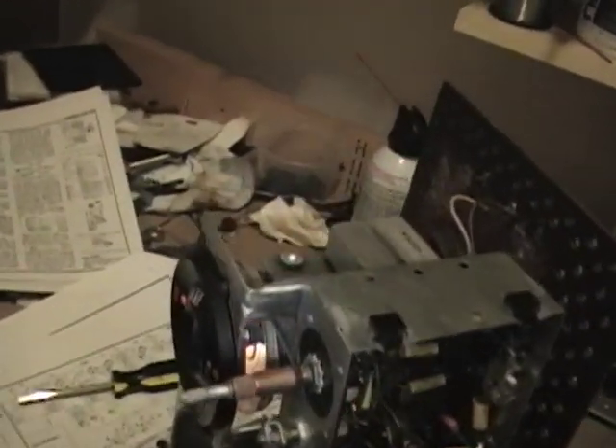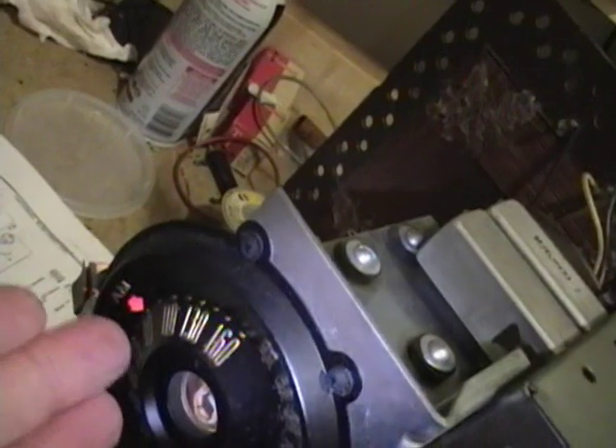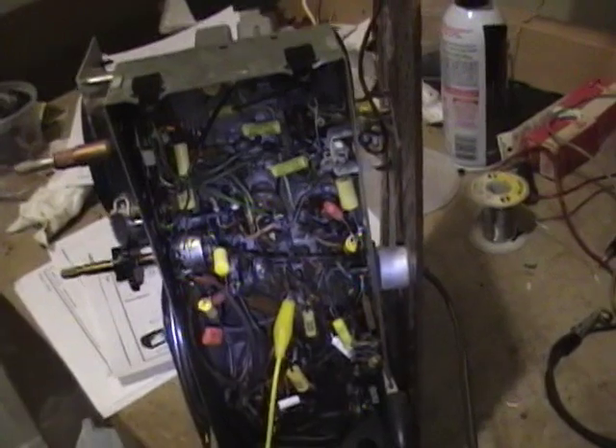The last thing you would possibly need to do is tweak the local oscillator. I've got the generator right on 1500 kHz — suppose when you look at your radio the dial pointer is pointing to 1400 kHz. To fix that, rotate the dial so it's pointing to 1500, then tweak the local oscillator trimmer capacitor up here so that the 1500 needle is picking up the 1500 transmitter. The needle is broken off on mine, so until I repair that I can't do that operation. That's all there is to it — I'll remove everything, disconnect the capacitor, and try to pull in some stations and see how the radio sounds.